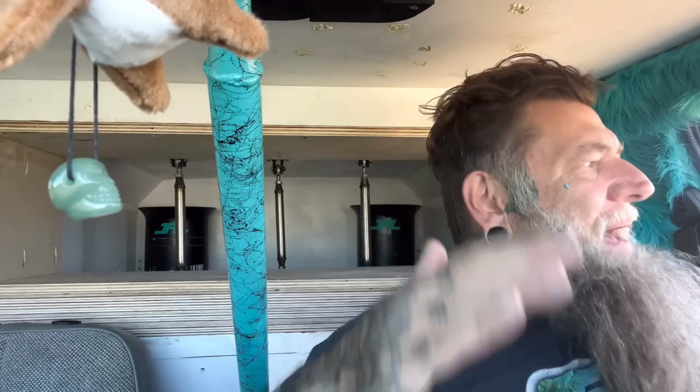A lot of times, if you have good power, that's why your sub gets stinky when it's new. Because you're basically just beating the shit out of it, heating the coil up, and it can't move enough to properly cool. Then after it gets good and broke in, it cools fine.